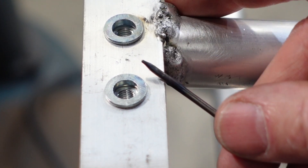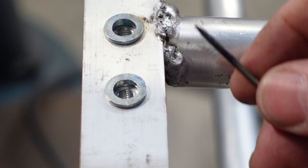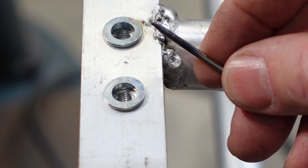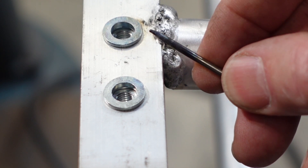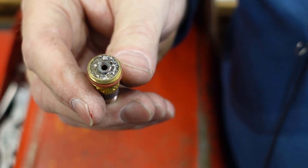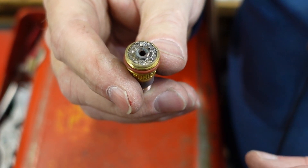I've tried a newly sharpened electrode and a different filler rod in case I picked up the wrong one, and still get this - so it's about the gas. I'm going to try with a new cylinder of gas and hopefully that'll clean up. I'll have to grind that off or clean it up. Sometimes the most important lessons come from failures - you've got to work out how to look at these things and figure out what's wrong. In this case, I'd suggest lack of gas.